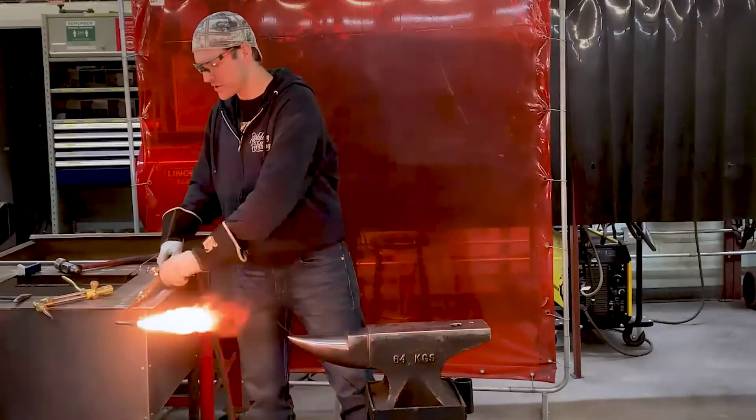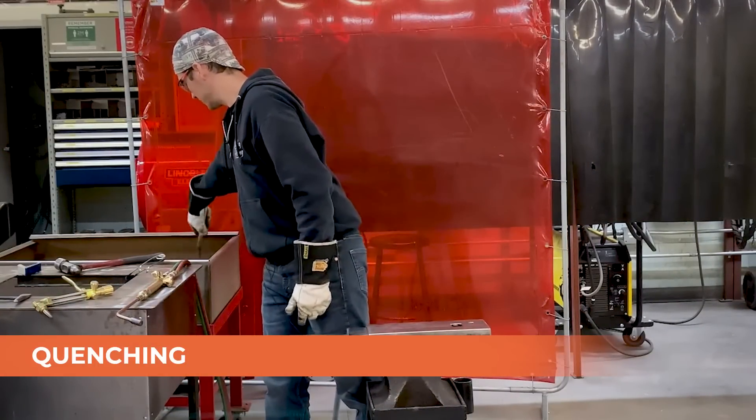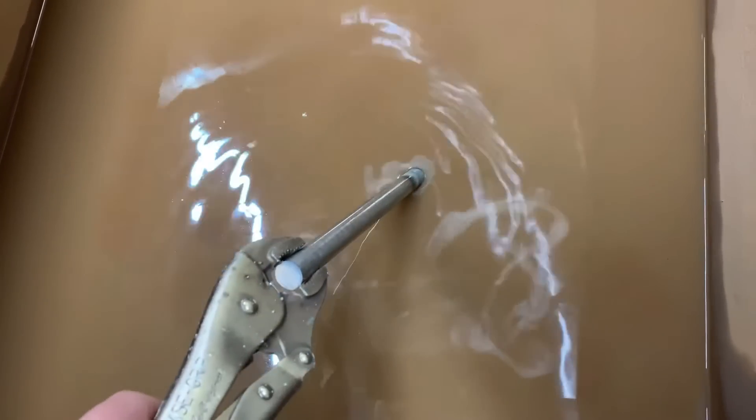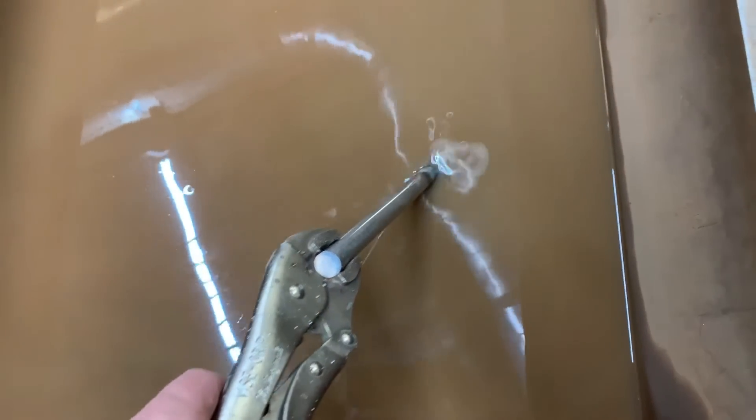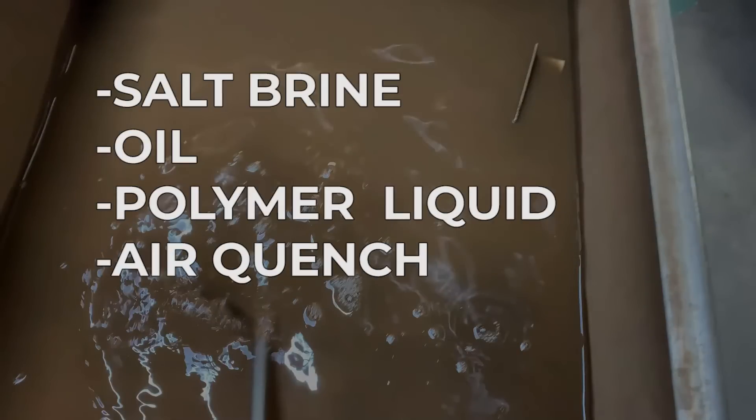Turn off our oxygen and acetylene. For this application, a straight water quench is used — I chose water because it's inexpensive and available. It's important to note that not all materials will behave the same when quenching. A water quench is the most rapid and aggressive quench, and in some complex materials can be susceptible to cracking. Other quenching media can be used such as salt brine, oil, polymer liquids, or even an air quench, which may be less prone to cracking.